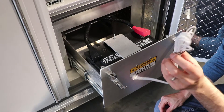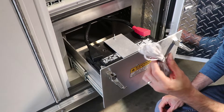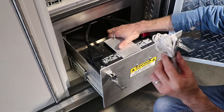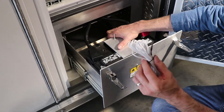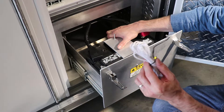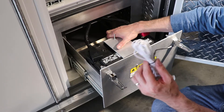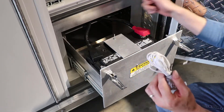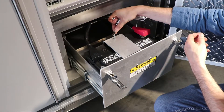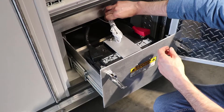What we're going to do is install the included battery temp sense cable. What this cable does is detect the temperature of the battery compartment or battery box. If this cable is not plugged into the front of the AP1500 inverter charger, the charger will be limited at 25 amps. If you plug this cable in, the charger now has full capability to go to 55 amps. What we did is just add a stud off of this bracket here, which allows us to slip this ring lug on, tighten that up, and then run this over to the unit itself.